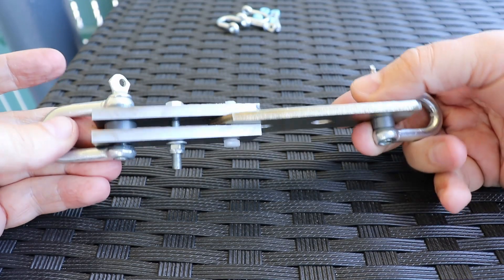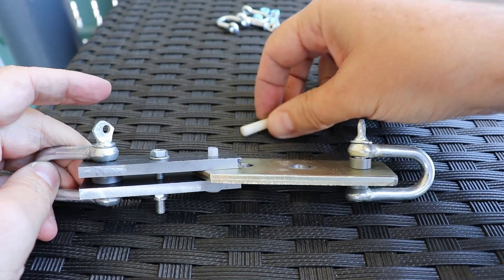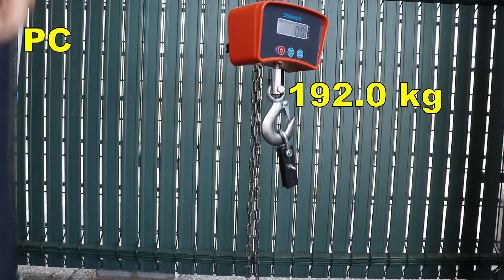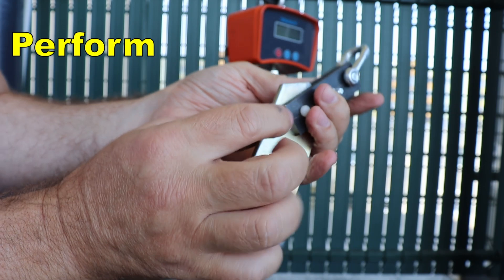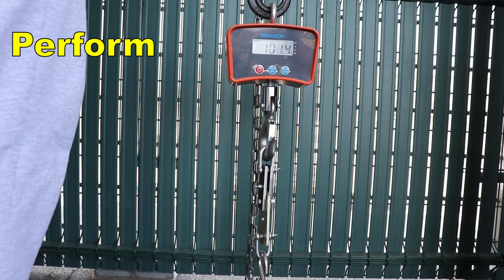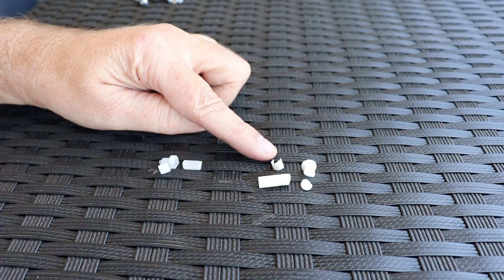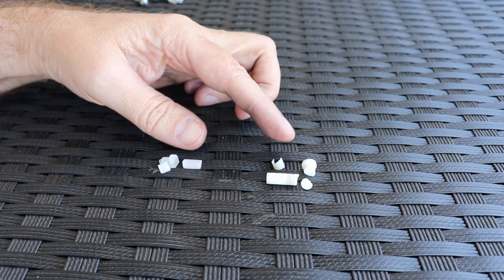And it is time for shear stress. It is double-sided but I will calculate the stress from the cross section areas because this is bigger. Here I had to use this bigger hole because this is 6 mm in diameter. Wow, this one exploded. For the filling the resin was stronger but it broke very suddenly — of course the diameter is also bigger. I will calculate the stress according to the cross section areas.